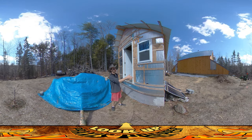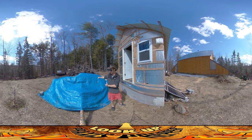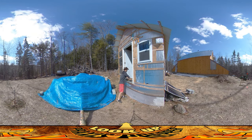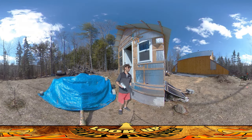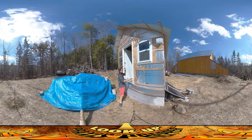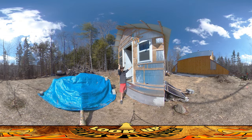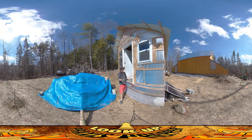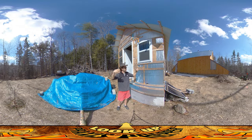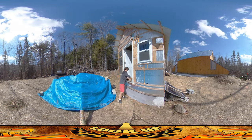The roofs look similar and the wall boards are going to look similar, but before I can get these painted and put up, there's a step I need to do beforehand — we're going to put electricity in the shed. When you walk in there'll be a light switch, a light on either end: one over your head when you come in and one on the firewall. A single point light source creates a lot of shadows; having one light at either end fills it in and makes it easier to see what you're doing.